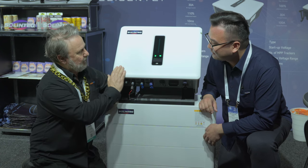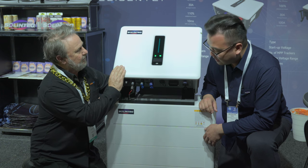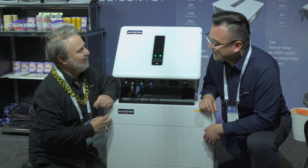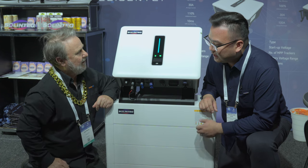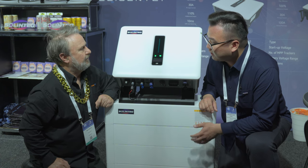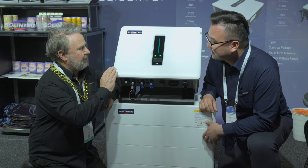And that will be paired with just a single input into this inverter. Yes. I guess that's one of the advantages of high voltage batteries. It's just a small plug, not a massive connector. Yes, because it's running at pretty high voltages. If we go to the 20 kilowatt hour, the voltage is above 400 volts. And I believe that makes for a very efficient inverter.